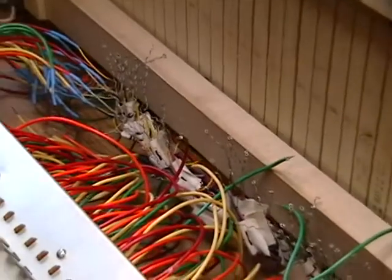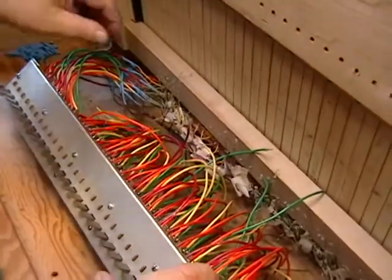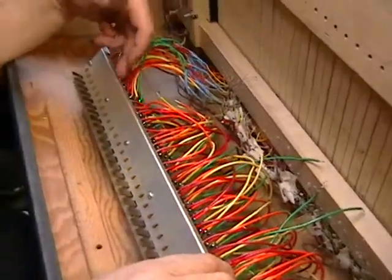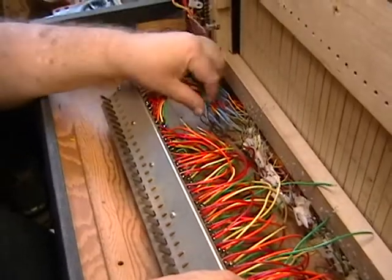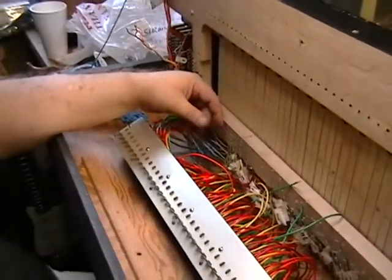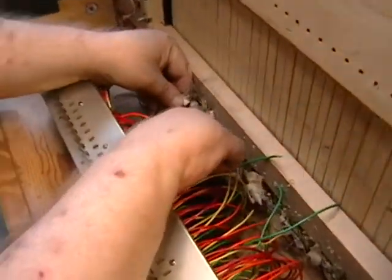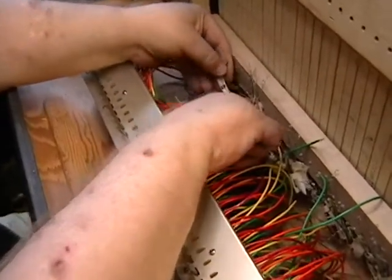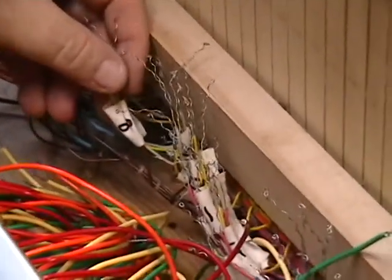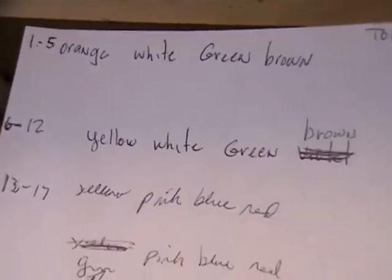Alrighty, we're putting the refurbished VOX Continental keyboard assembly back together again. And as you can see, we've lengthened the leads off the actual contactor strip, and we're putting it back in the harness. What we've done is, when taking it apart, we made a notation of what colors are which for which footages, and we've managed to segregate each one by key and put a number on it. So this number 8 that you see is key 8, and for key 8, the footages are yellow, white, green, and brown, and they are from top down.